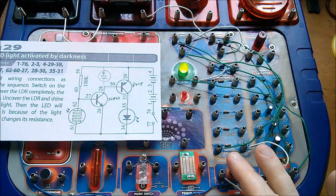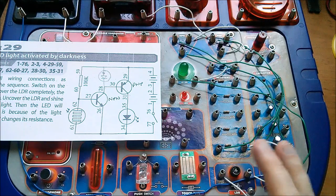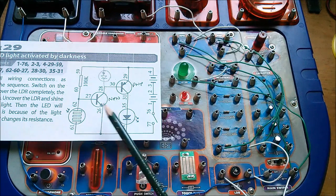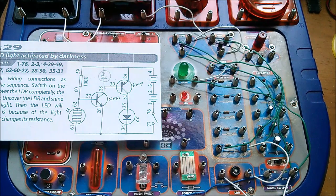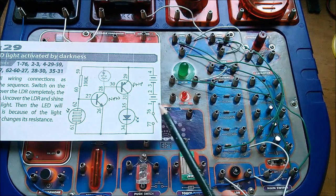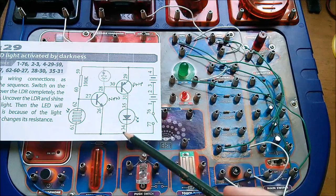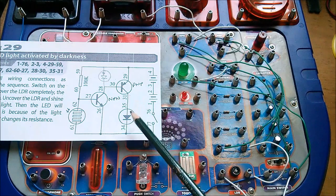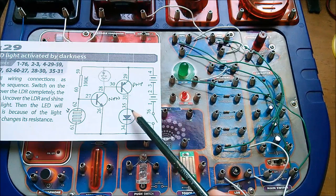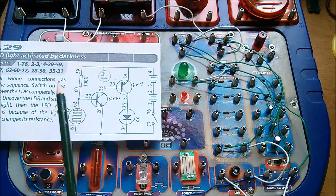Back to the original configuration, and it's nice and sensitive to moderate levels of light and dark. The switching is nice and quick because I've got both transistors in there — the gain of both transistors are involved in the switching of the circuit. But there is something about this circuit that bothers me, because there's a current limit in the main output path: there's a 100-ohm resistor in series with this LED. I checked underneath the board yesterday and it's just been soldered into one leg of that LED, so that's okay.